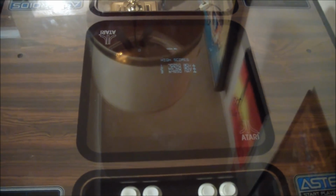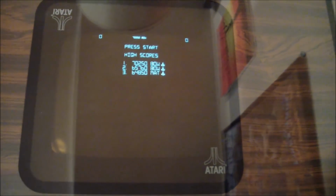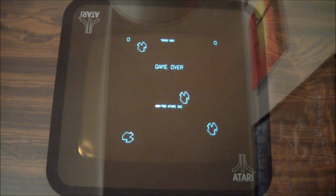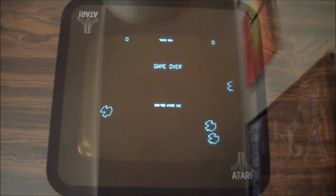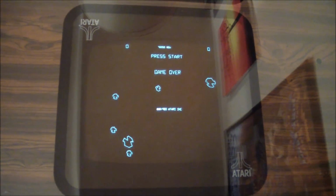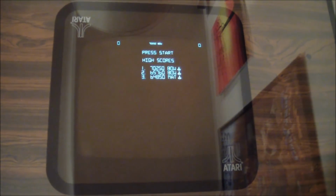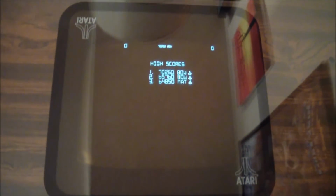Can't see anything. Oh, there you go. Well, it comes up and goes into demo mode properly. So even though it did complain about that RAM, which by the way I looked it up, it's one of the vector RAMs, it's a static RAM, it seems to be working okay. Well, that is probably something we'll chase down when we get the monitor fixed.